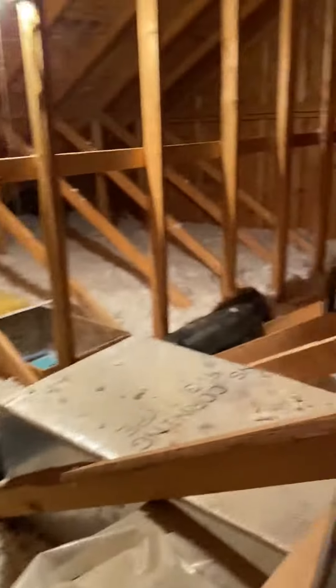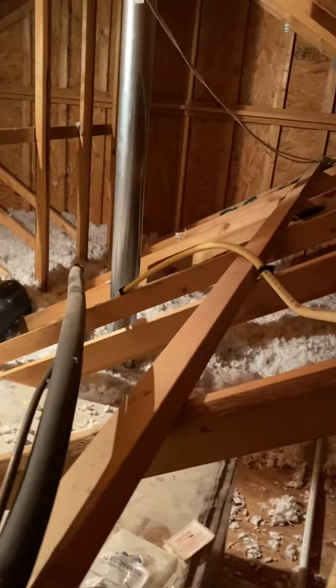There is a pan that most of this is sitting in. Looks like the coil's hanging off the end of it just a tiny bit. We should be able to reuse the pan, I believe. The line set we'll just need to flush — it's going down right over there. Drains look like it's PVC, it's all hard-piped.